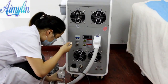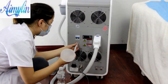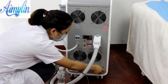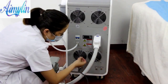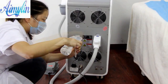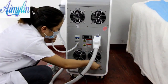This is the filling filler, and we have prepared pure water. Screw up the water inlet and water overflow before filling. Connect the filling filler with the water inlet, then add water until water overflows from the water overflow hole — that means the machine is full of water. After adding water, screw on the water overflow, remove the filler, and then screw on the water inlet.